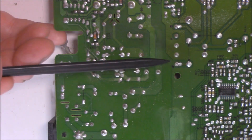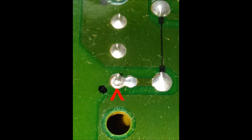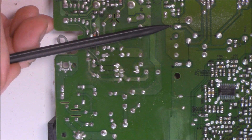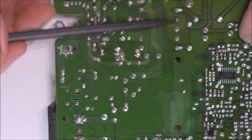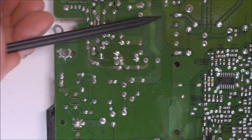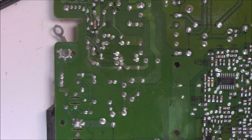I have been caught out before where I thought I had it and got it wrong. But in this case, there's definitely an issue with this particular pin here — and this goes on to a transformer on the back end. This little guy over here goes on to another pin of the transformer. So these are our transformer pins along here, and we've lost one and a second one, either end of it. Once it heats up, you're going to end up with all sorts of issues. I'll solder these first, then I'll check the ESR on all the caps on the other side as well.